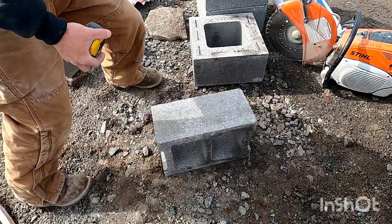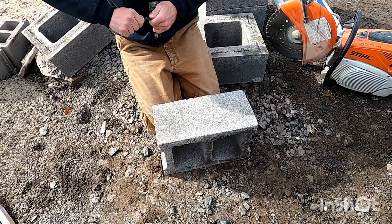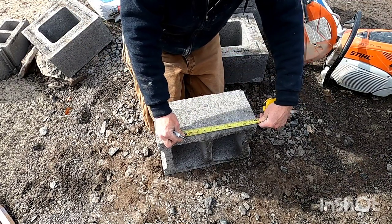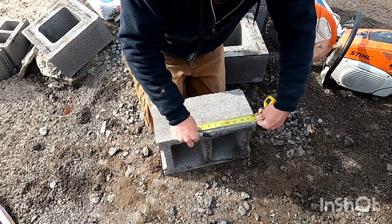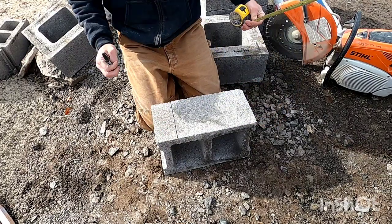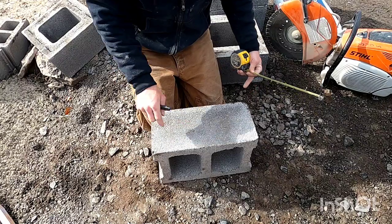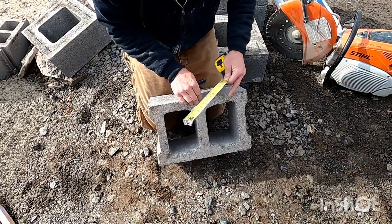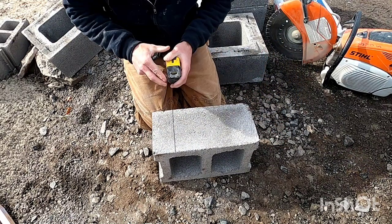This is how I mark my block. Instead of measuring, marking, and straight-edging, I just find 12 and a quarter — my number — hold my finger right against the edge of the block at 12 and a quarter, put it there, and slide. I don't have to move my hand. Make sure you flip it over exactly like this so you don't put the mark on the wrong side. You want it on the same side, then again mark at 12 and a quarter and slide it off. If you've seen that before or use it yourself, please comment your experience.